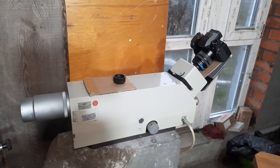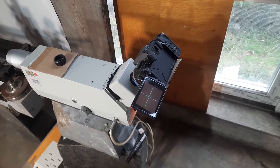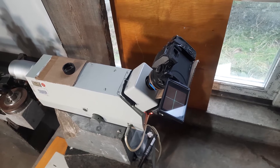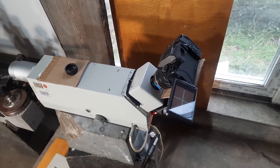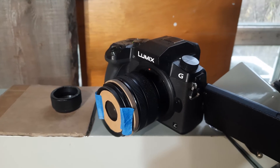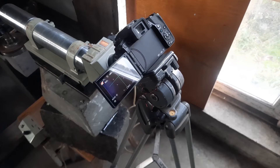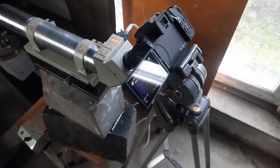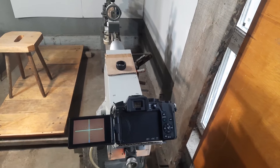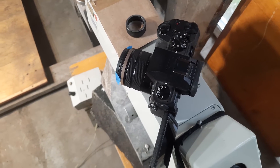To allow you to see everything for yourselves, I've adapted a video camera to the autocollimator's eyepiece. It took a lot of effort to shoot the video with sufficient quality. I spent almost two weeks trying various filming methods, adapting the camera for this task, and developing a way to process the obtained video. It's significantly more complex than it might seem at first. For instance, moving parts in the camera's autofocus system, which don't affect the quality of regular video recording, unpredictably caused minor image shifts, breaking the required image stability.